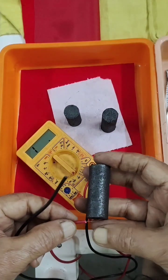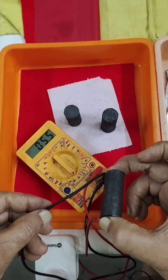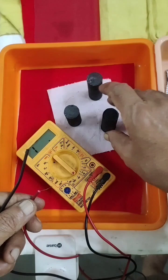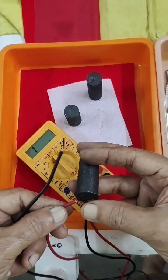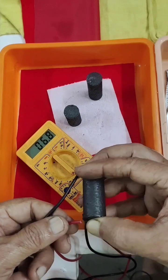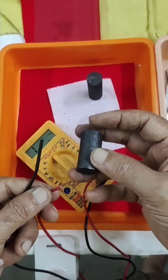You can see the resistance is reducing. After curing you will see less than 5 ohms — we will demonstrate that now in front of you. Right now it is reading 5.56, then 6 and 5.9 ohms. After curing it will go to less than 3 ohms.